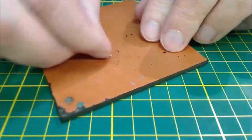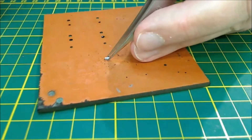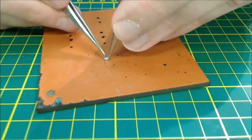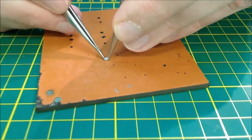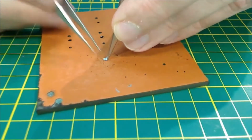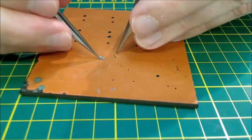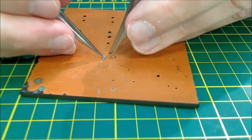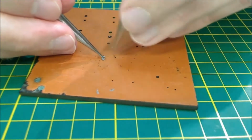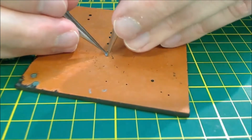Now, there they are all folded up. Holding it at the sides, keep these layers of etch in line from side to side, and then push down on top to squeeze up those hinges and make them flat. And what this will probably do, they'll not stay perfectly in shape, they have the tendency of squeezing out of line top to bottom. So I can go back in and squeeze them up again top to bottom. Do it from both sides and make sure that these are in line.